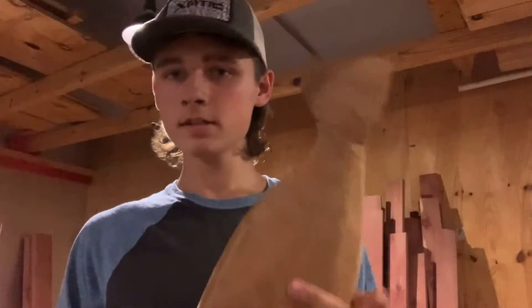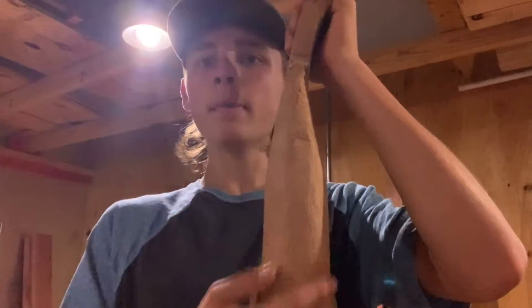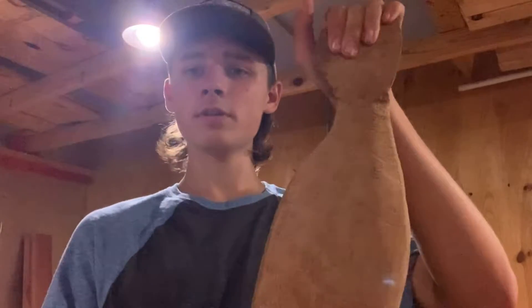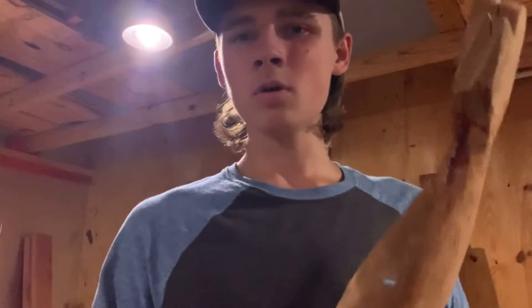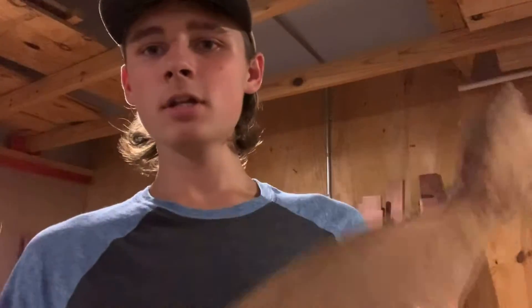Three things: the top turned out a little bit thicker than the bottom — I want the bottom to be a little bit thicker, so I'm going to thin out the top a little more. Second, the reciprocating saw caused a little piece of wood to fall off, and that's going to happen with this western cedar. It's literally lighter than a football — it's insane how light this stuff is. It will recoil and break off if your wood grain's not dense enough.